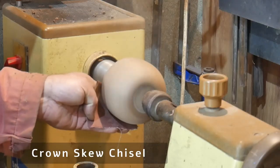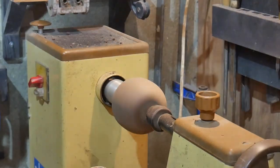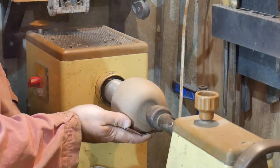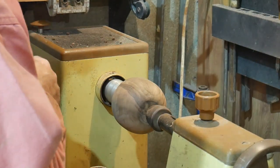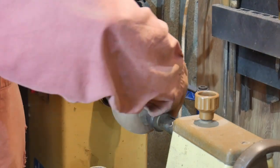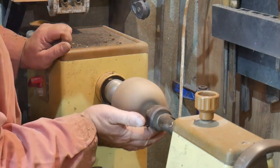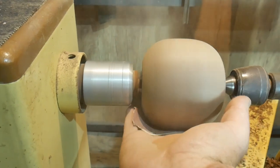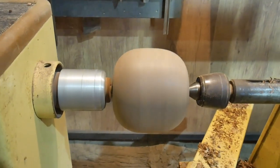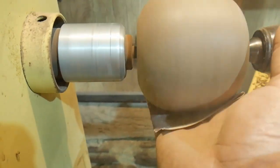Finally we have its shape and now we're sanding the block of wood - it's very round, though not quite as spherical as I first envisaged. When doing any sanding work with the lathe, wear a mask. It's also a good idea to have a vacuum cleaner mounted close by to suck up as much dust as possible as it leaves the piece of work - better in the vacuum cleaner than your lungs.